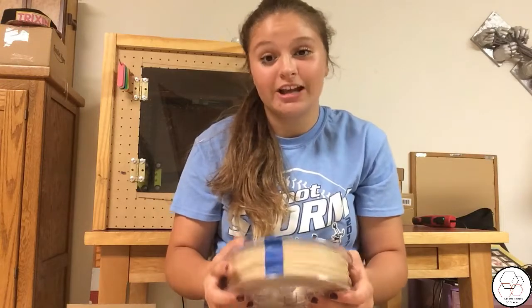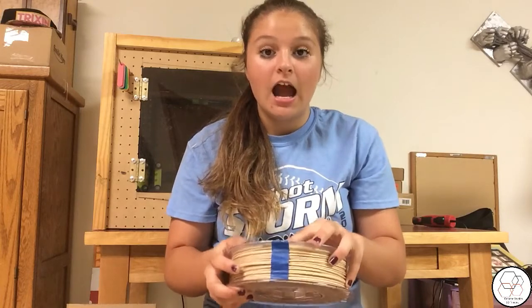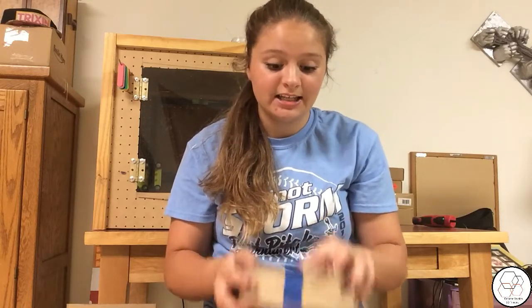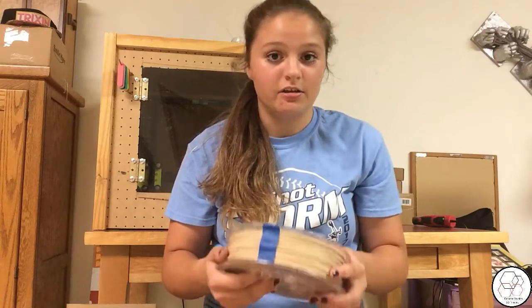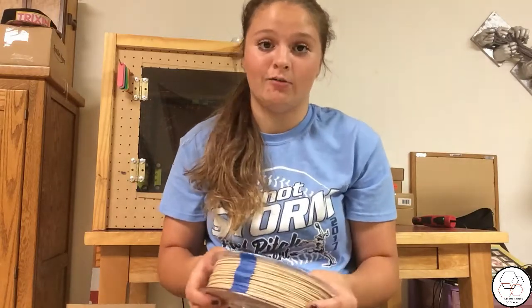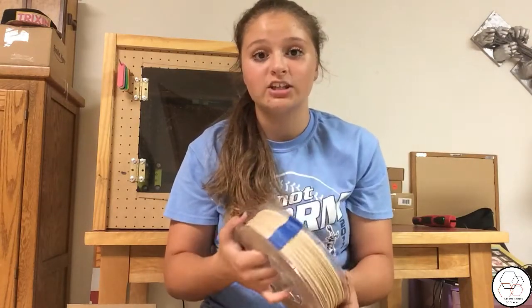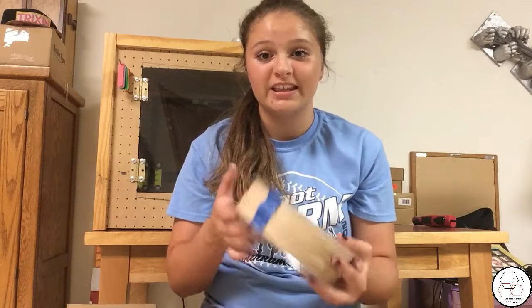I did take that off already and this filament actually has a nice texture to it. As you can see right here, it has a temperature range of 165 to 180, which is pretty low actually. I am printing it at 190 degrees right now, but the bed temperature is 40 to 50. I did print it at 60 degrees just to make sure it adheres to the bed, and that has been working out pretty good. Big thanks to Unico-Phil for sending me this filament and the other filament I did a review on already — don't forget to go check that out, I will put a link in the description and at the end of the video.